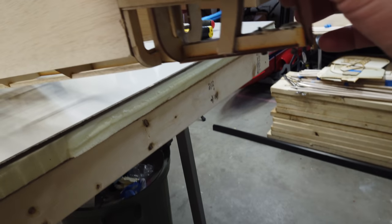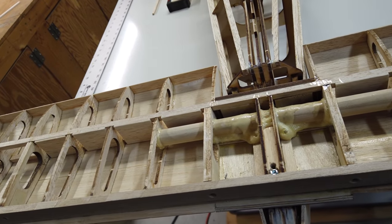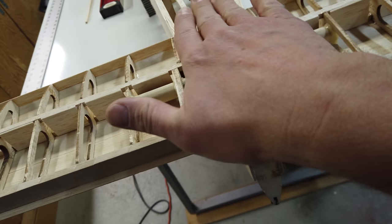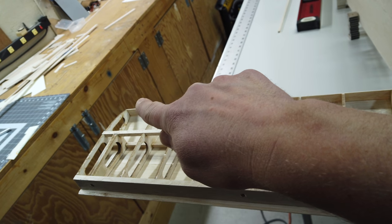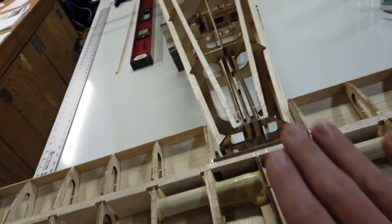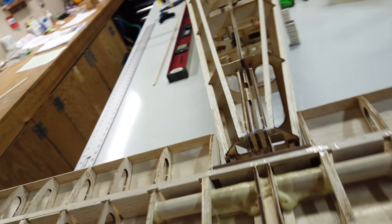It is the next day — the tail section is all cured now with the ply plates reinforcement and we are a heck of a lot more solid. The ply we added on both sides stiffened up the twisting motion of the horizontal stab. Our measurement from the leading edge to the wing tube is exactly the same on both sides, so we've got our final position figured out. We'll have to do some sanding but that part is essentially done.